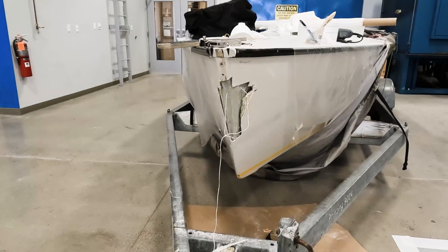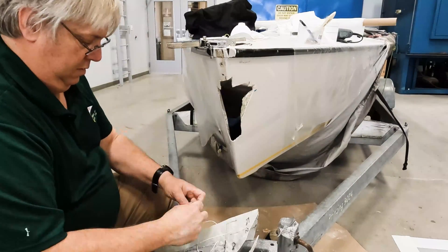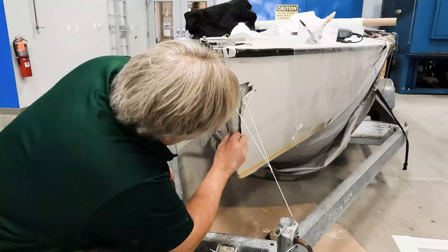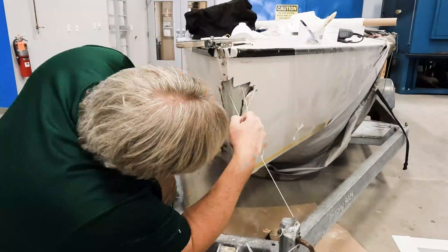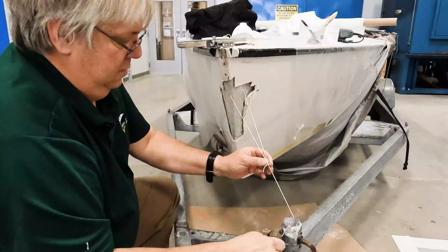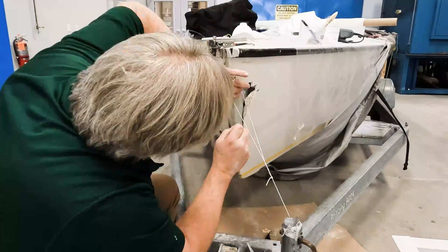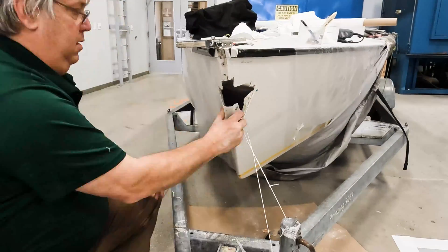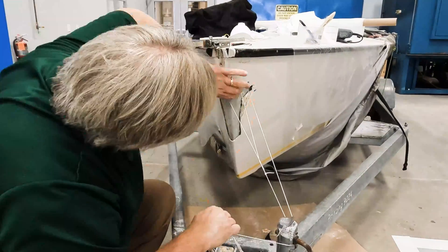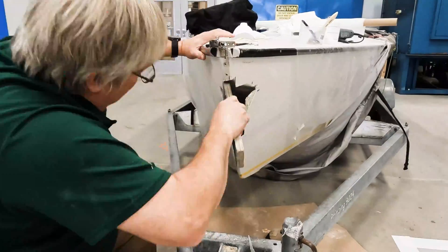In this case there's only one way because you can't really access the inside — if you can get to the back side, a lot of times you can use a two-by-four or something to prop it in there. It'll take a number of fits and trimmings to get it to fit correctly. Once you get it fit up, you need to sand and prep the inside to get the epoxy to bond, since this mold will be left in place as part of the structure.